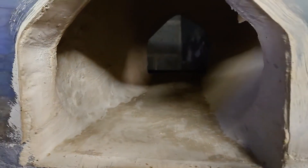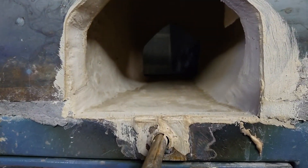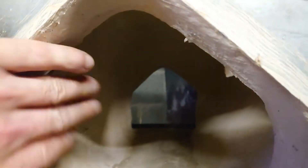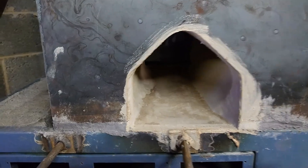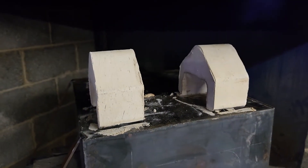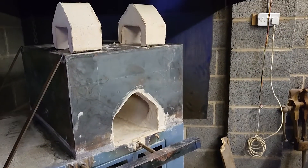I also performed a little modification inside: the left-hand wall is now almost flush. I decided to take a bit of volume out of the forge because it was just a little bit too much for my liking. It's still benched but now this wall hasn't got the big dip in it - it's basically level with the doors. It's all been painted now in zirconium paint, and the doors are also painted.